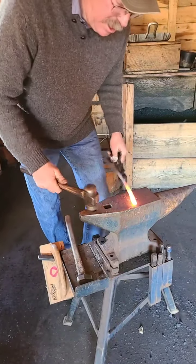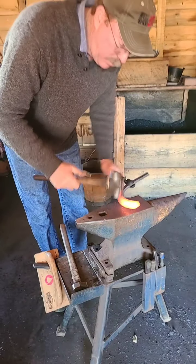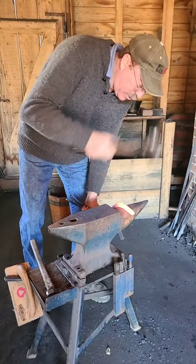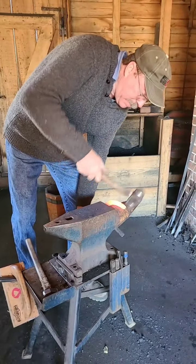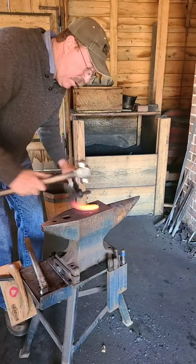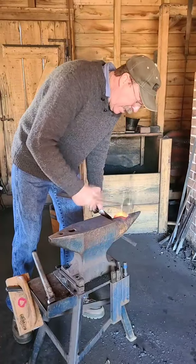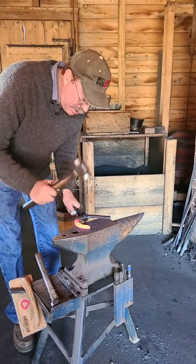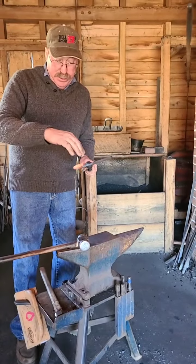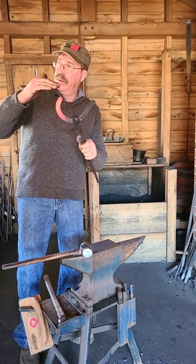So that's just forcing the heel on there, because you can't have a square. If we had a horse here, we would try to correspond that to his heel and his foot, because they're so different, depending on the angle you want to come in. So you're fitting that to a particular horse. Yeah, you fit the heel also. Some horses will have a kink, and it has to do with the angle that you come into the heel. So if this got a kink in it, this is not as pointing toward the center.